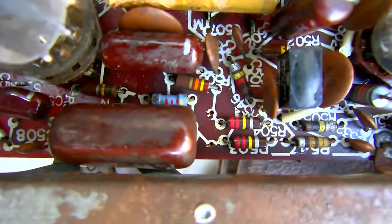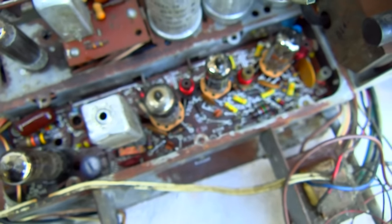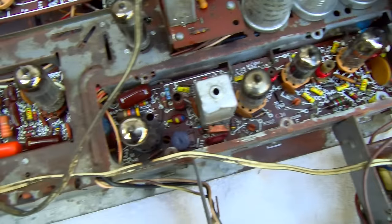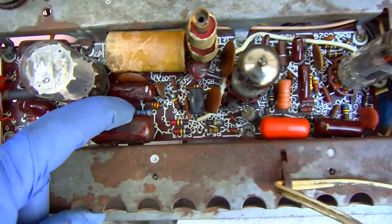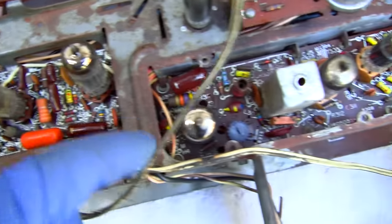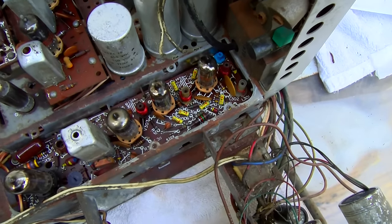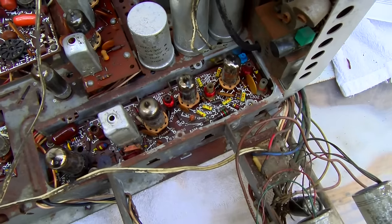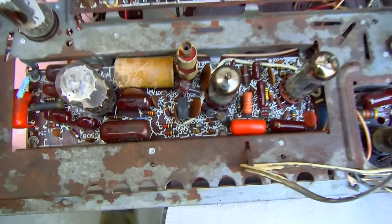The first thing I'm going to do is lift that capacitor - that little blue one right there. I think those are tubular ceramics. I had two of those short in the IF in part 3, going up in smoke and flames. It's possible that pressure washing the board damaged those little ceramic capacitors, and there are a lot of them. I'm going to bet that thing is shorted.